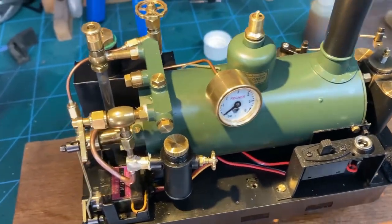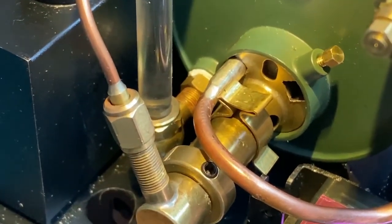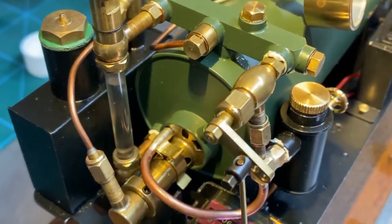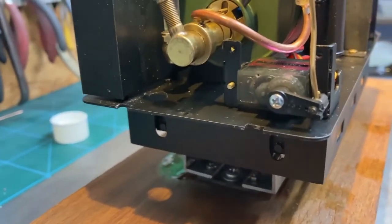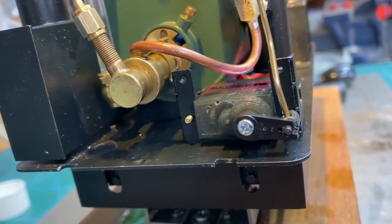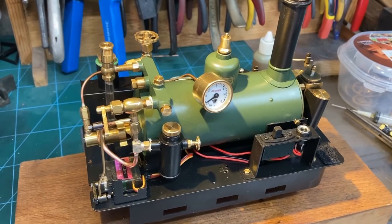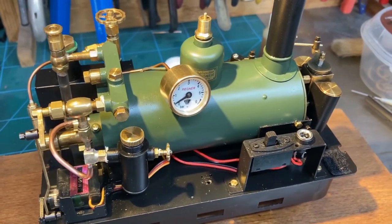I have machined a second air hole in the burner at the bottom. The burner has lit quite easily again, and you can see it there — you can see the blue flame? I would say it was noticeably quieter than before. So, just wait until it gets up steam and give it a go.